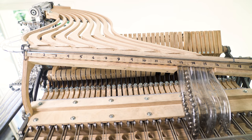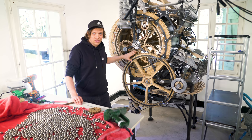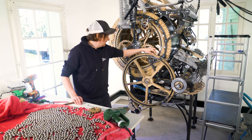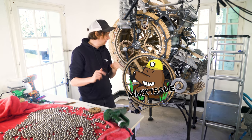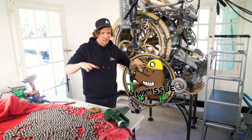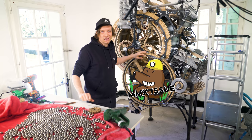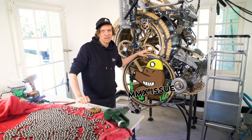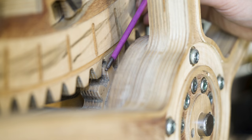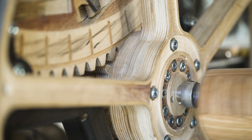While I'm preparing the next steps in the pressure process, I wanted to show you something I did with this gear before another marble test — we couldn't fit it into that video. The gear was running very wavy, not running straight. This gear was never glued together; it's made from two pieces of plywood. I always had the idea that if I put it on a flat surface and glue them together with a lot of pressure, maybe I can make it straight. This large side gear is dancing around — it doesn't look straight, and sometimes I think it causes unnecessary vibrations and inaccuracies in the powertrain of the Marble Machine X.